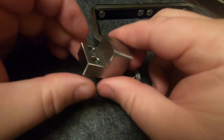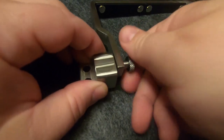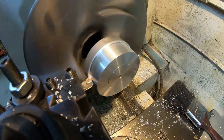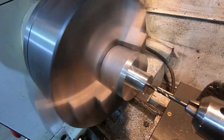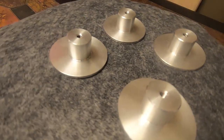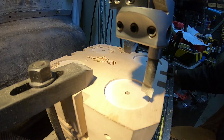The handle attaches to the body through L-blocks by means of custom bolts. Sadly, I've never gotten the hang of reliable knurling, but they work okay. The details here were largely guesswork on my part, as only the L-block is visible in any of the pictures. The urchin caps are simple aluminum stepped cylinders, turned on the lathe — a lot of material to remove, but otherwise very straightforward. I've threaded them all the way through, as later pictures show rubber bumpers attached to these as well, even though they're missing in the Trinity picture. The caps also serve in my version as the nuts for long threaded rods which hold the top of the body to the bottom section. When finishing the top of the box, I carefully bored out cavities of the exact same thickness so they would sit flush with the top.